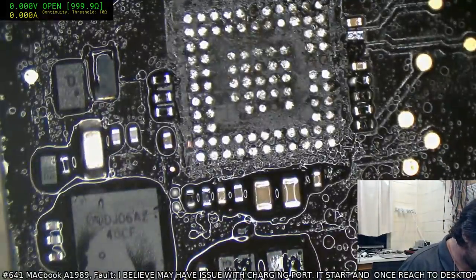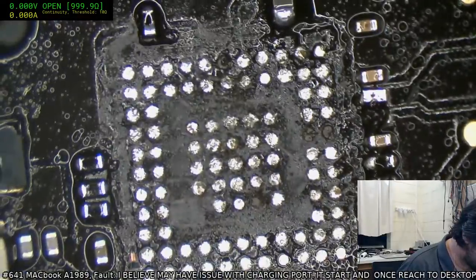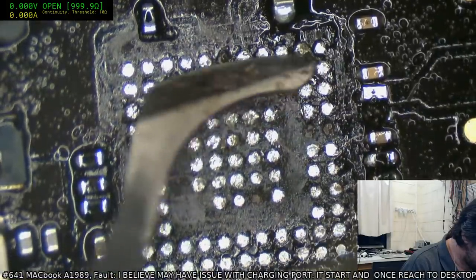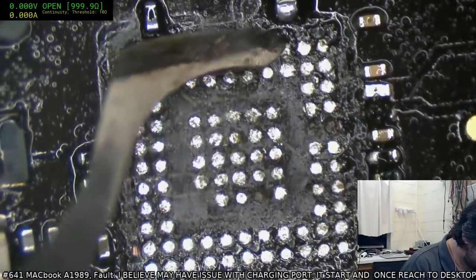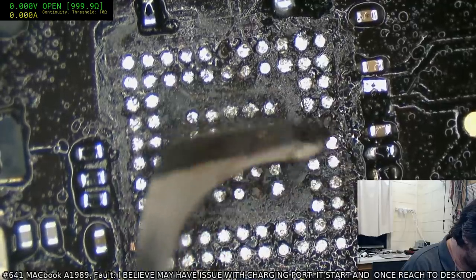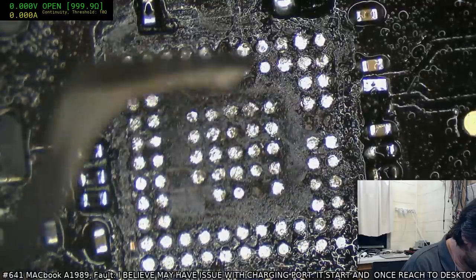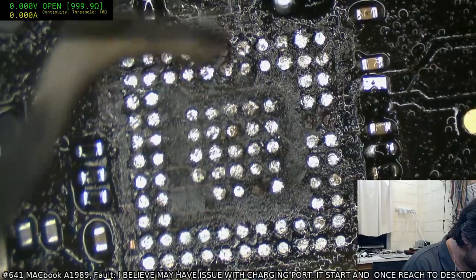Minor bulging, yeah, okay, so the bridge. It's not minor, and it's cracked through, which means the magic smoke has escaped. What is probably interesting though is the control logic, or the communications logic, is probably okay, but the MOSFET or the LDO or something in there, power related, probably went pop.